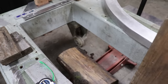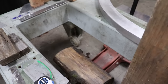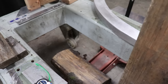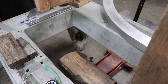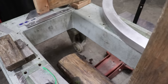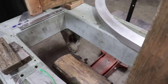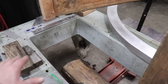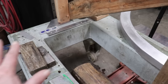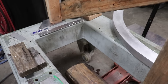It's just a floor jack and a log out of our forest. We just hit it with the planer a little bit to get rid of the knots that were right there, to give a fairly smooth surface so we didn't have any lumps or anything. And yeah, we just lift it up against the inside of this plate and that kind of forms the die, I guess. And so just work it along slowly, every inch and a half, 2 inches.